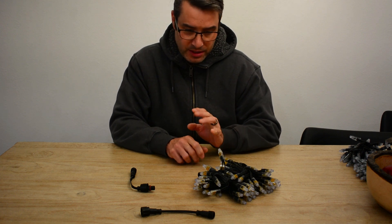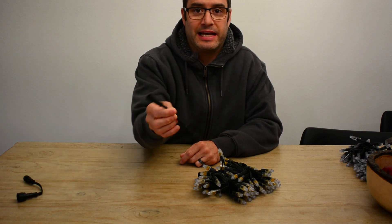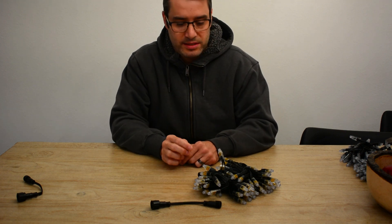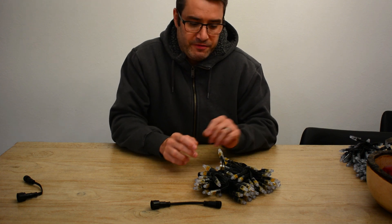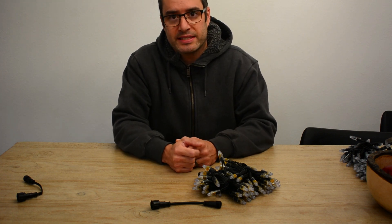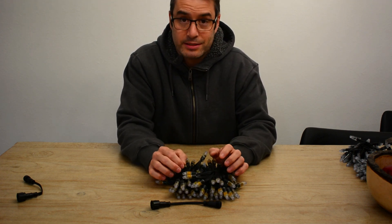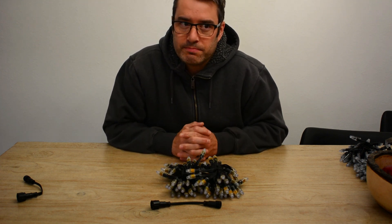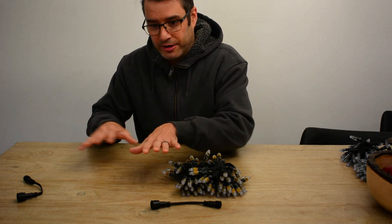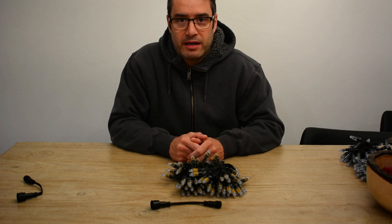Before I got the correct adapters, I was experiencing some really interesting behavior. For instance, if I had too many pixels plugged in there was a startup sequence that these would run through, and sometimes it would get stuck in a cycle if there were more than 200 pixels. That's why in the last video I said to limit to 200 pixels. Reason number two: around pixel 280 I was getting a random light that stayed on. If I switched the strings, nothing was wrong with the pixels themselves, but around pixel 280 every single time there was a random pixel that was on.